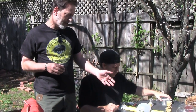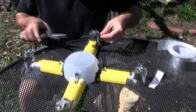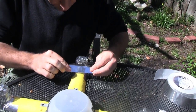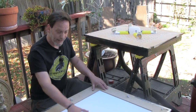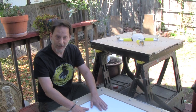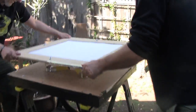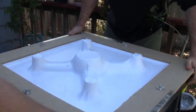For the first frame prototype, we decided to raid the Tupperware cabinet in the kitchen. So basically we have a Tupperware container, four shot glasses, and four corn on the cob holders. This is going to create the mold that we vacuform over. This piece of styrene is being held in a frame and it's being heated over four hot plates. Over the course of about seven to ten minutes, this whole piece will get nice and soft, start to droop down and become really plastic. When that's the case, we're going to quickly lift it up onto this table where the vacuum will be running, sucking air into it, forming a perfect reproduction of a shell of this shape.